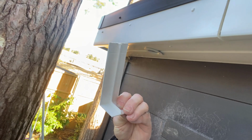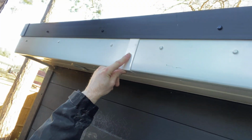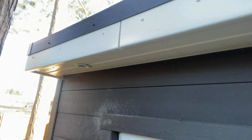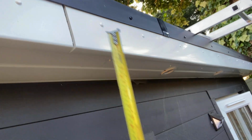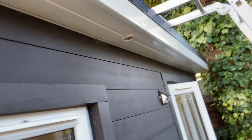This one I've cut, so as you can see, that little joint through there goes to the centre, up like that, done and dusted, okay? Easy peasy. But what is very easy to do is you can measure it wrong. I know that sounds like a stupid thing to say, but you take that and you measure there to there and you go, oh, it's 11.5. And you cut that off the front of this, you'd end up with the wrong size.